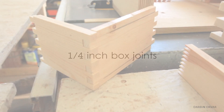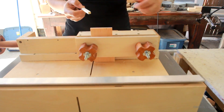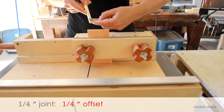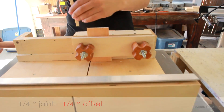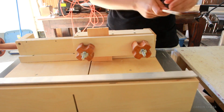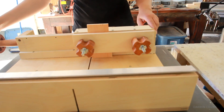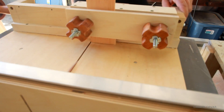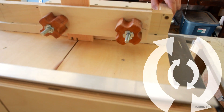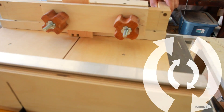Let's move on to the 1/4 inch joint. For a 1/4 inch joint, the offset needs to be 1/4 inches in order for it to be right. Again, either mark out on the piece or make a spacer that you can reuse. Then arrange correctly and start cutting. For a 1/4 inch joint, the pattern is this: cut four times with a spin in between each cut to move it forward, then spin six times. Then cut four times, spin six times, and so forth.